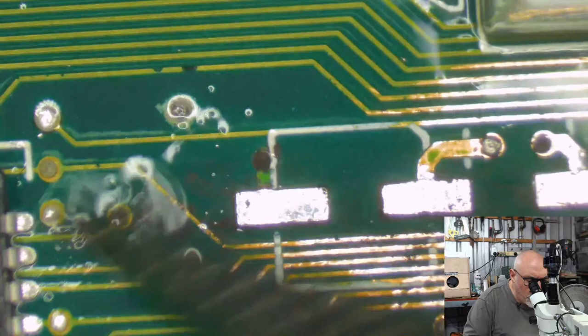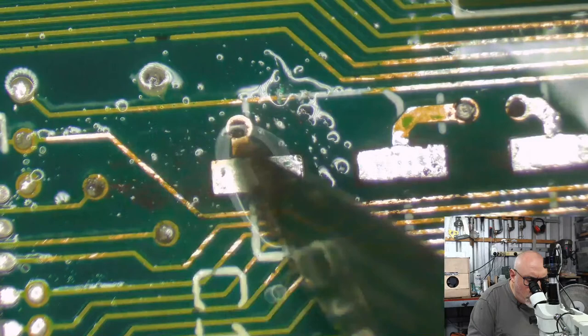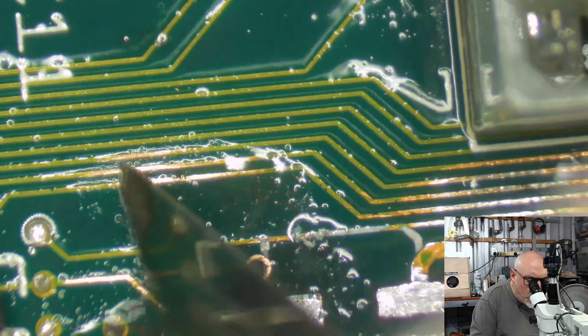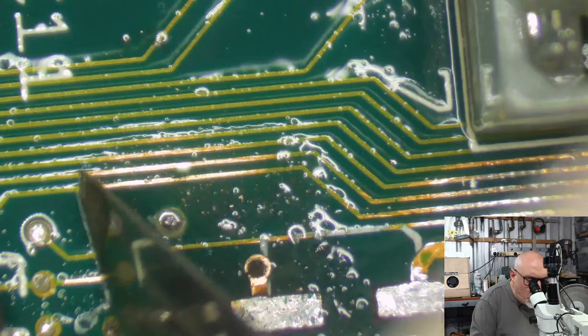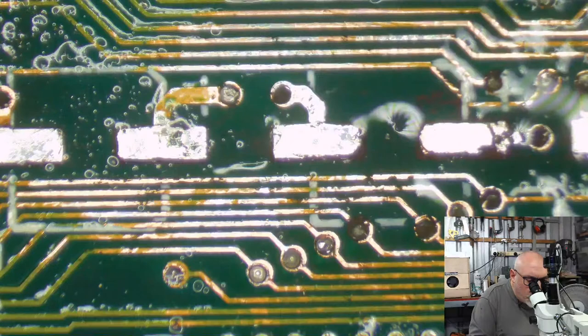It's because of the way that I solder, and I tend to solder where I use a really, really hot iron, and I look at that trace break, and then I regulate the temperature with how quickly I have the iron on the board. I move it around quite quickly, that sort of thing. So just so you know, I have my iron set on 450 degrees Celsius. Now, do I recommend other people do that? Absolutely not. It's how I like to solder, but it's not necessarily what I would recommend to others.